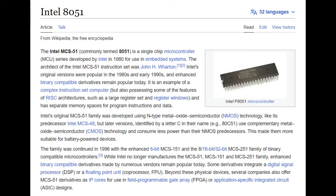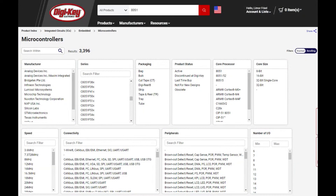Traditionally, if you open up a toaster oven, it's probably running a microcontroller with an 8051 core. These 8-bit microcontrollers — even this core from the 90s — are still very popular. I still buy chips with an 8051 core today. They're very low cost, not super fast, but people are used to them. You can add a bunch of peripherals and there are compatible cores without a lot of IP overhead, so they're under a dollar basically.